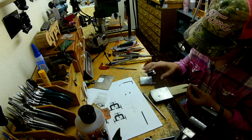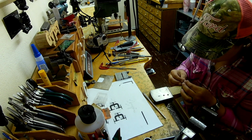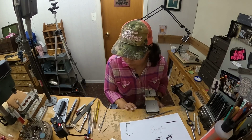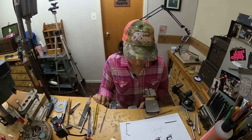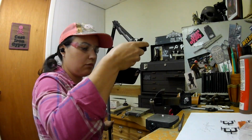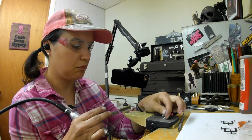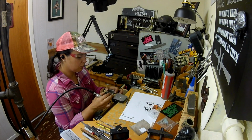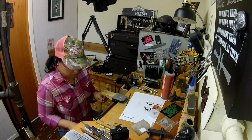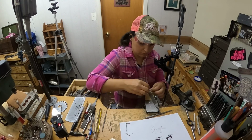While I wait for the rubber cement to cure, I'm working on those little dapped jaw pads. I'm just sanding them flat and filing the edges and making sure that they look really nice and intentional, and re-drilling through the holes in the center because they got warped a little bit in the doming process. So now it's wide enough that I can thread a piece of wire in there and then use the wire to help me file the pieces to be really nice and consistent.